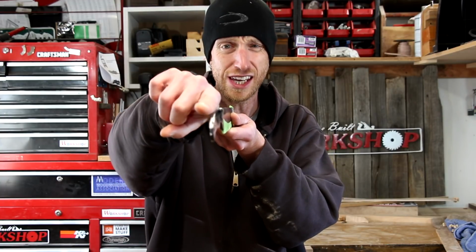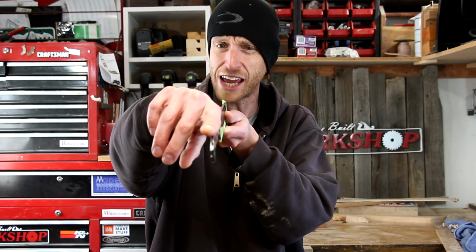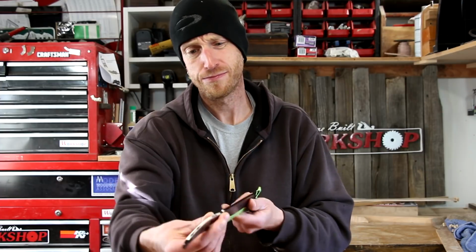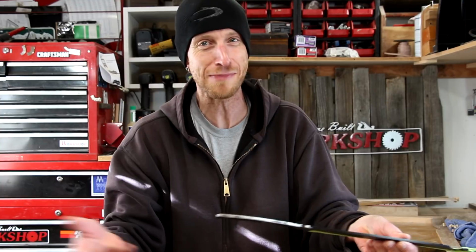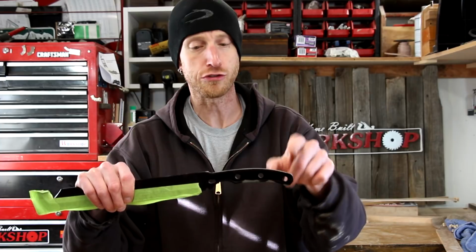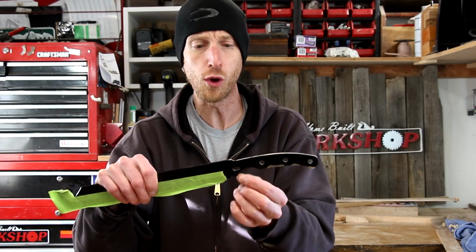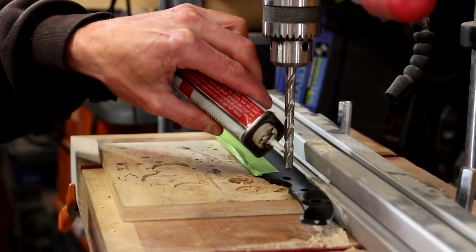As I look at this blade, I don't know if you can tell, it has got a curve in there. It's not really straight. The front portion of the blade is good, but where the handle is, it's got a little bend in there. I think it'll be okay. Not perfect, but it's a $3.49 machete. What do you expect? There are 3 holes that are the same size that I can use for some brass pins. The 4th hole is kind of a slotted hole, and I believe that's where that little Corby bolt fastener was. I'm gonna drill that out so that it matches the other 3 holes.